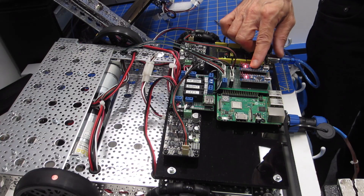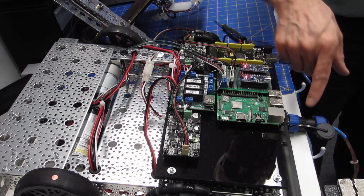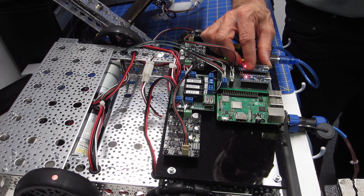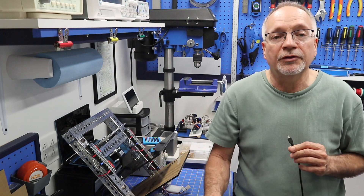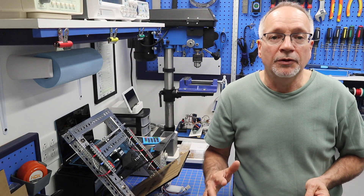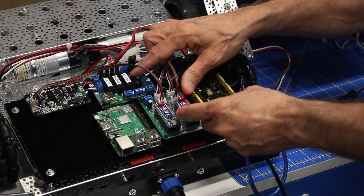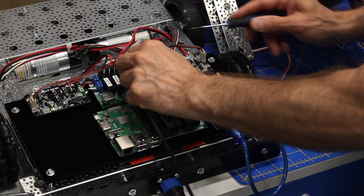Here are a couple of things I've been doing to avoid it. The first thing you can do is simply take the Nano out of its socket, power everything down, and go program it — I've done that a few times. But there are times you want to program it when it's on the robot, especially if you want to use a serial monitor, which I'm doing to read back from the rotary encoder. The best way to do that is to go to the 5-volt fuse over here and remove the fuse temporarily.